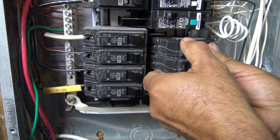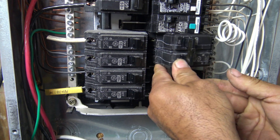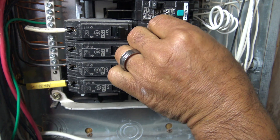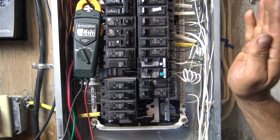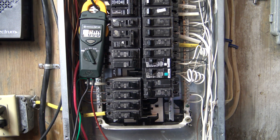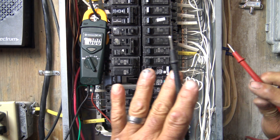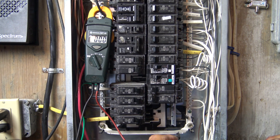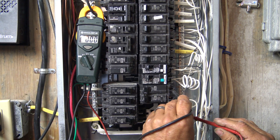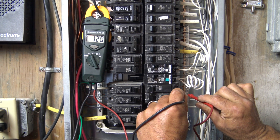There's a little hook on the breaker that connects right into this strip here — it's going to lock in. Go gentle, it locks in — feel that it's locked in. It's like a little hinge, then push it in — boom — and it slides right on and is now connected. I went ahead and turned my panel back on and I'm going to turn on the breaker we just installed — this is for testing purposes only. Remember, we're all hot here, and if you're scared to be this close to a live open panel, honestly you shouldn't be doing this.